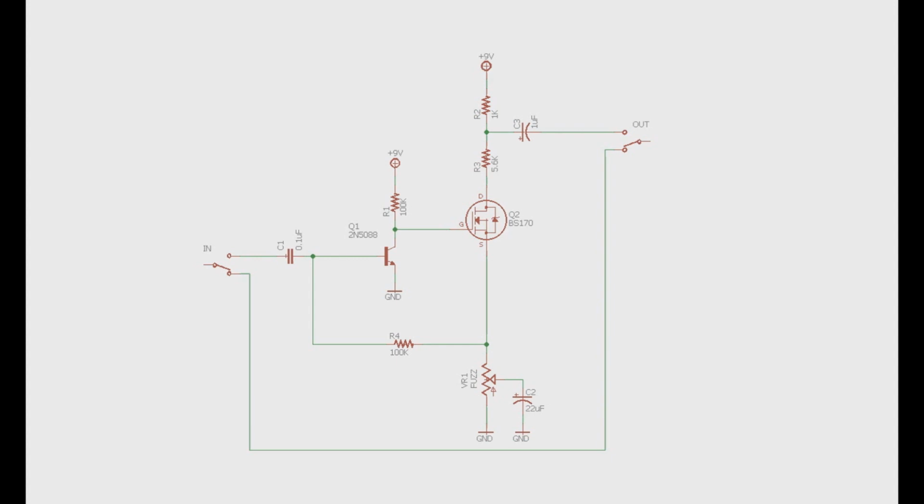of your pedal. With the pedal bypassed, these voltages hang out at the ends of our circuit, and when we engage the pedal, these voltages have a place to go. The input side reacts as a small signal pop, which the pedal will process as if it was your actual guitar signal. The output side will also react as a small signal pop, which will then go into the next pedal or out to your amplifier as if it were your actual guitar signal.